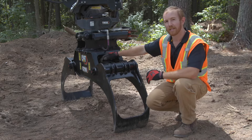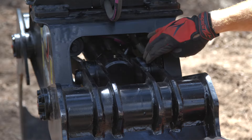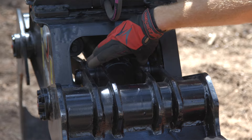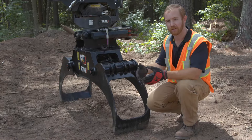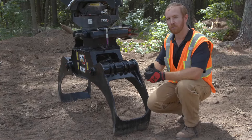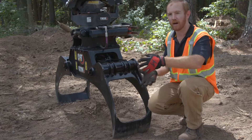The next thing is the way we link the cylinder to the grapple arms. We've got dual connecting links centered in the grapple. What these dual links do is maintain the relationship between the grapple arms so they travel together equally, and they also prevent twisting and bending of the grapple in the event you grab an odd-shaped item.